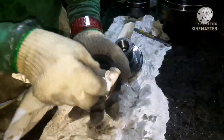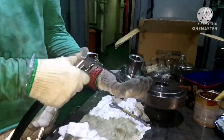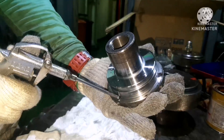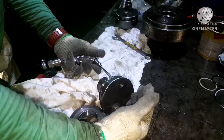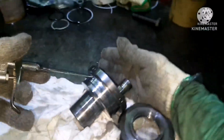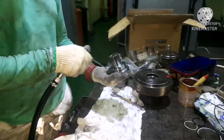Now we need to clean the cylinder surface with clean rags and ensure the o-ring and backup ring groove is clean. This area will usually be clean since we are using only hydraulic oil, so there is very little chance of it getting dirty. Blow air through all the vent holes and ensure air is coming out — that means the passage is free. Ensure all hydraulic oil passages are clear of any dirt, then clean with rags. Do the same for both piston and cylinder.